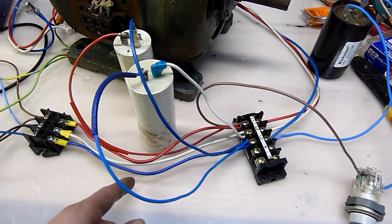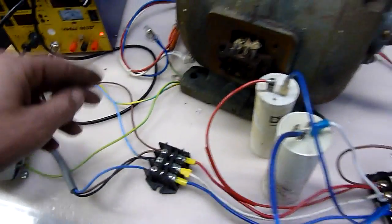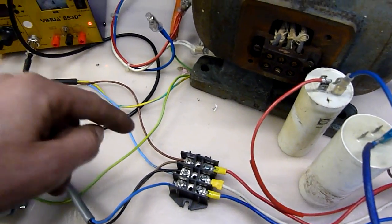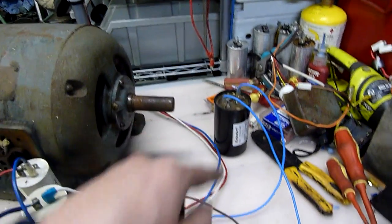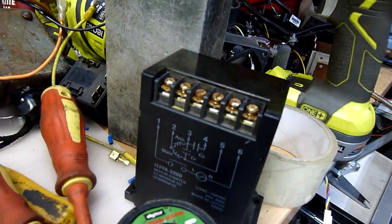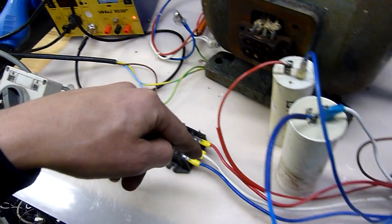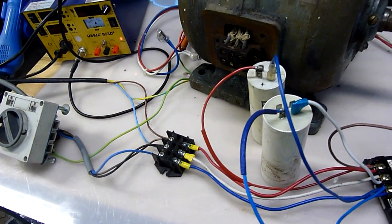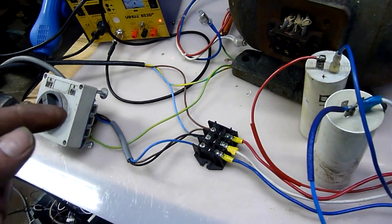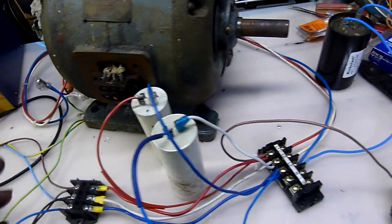As you can see, the emulated phase is L3, going through from the load switch. Mains input goes to L1, which goes to one of the caps, then to a momentary start switch to the start capacitor - eventually that'll be something like a compressor starting relay. Neutral from mains, 240 volt mains goes to the white wire which is L2. I'm using standard colour coding: red, white and blue for 1, 2 and 3. I know there's also brown, black and blue for three-phase cable.